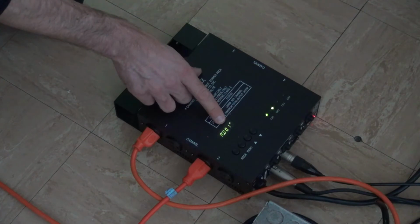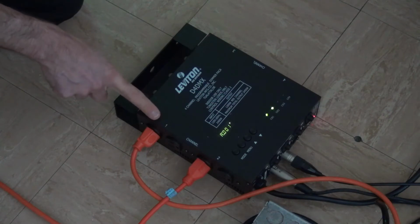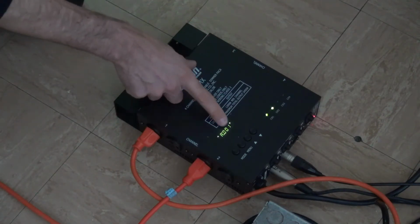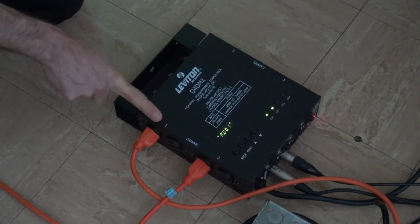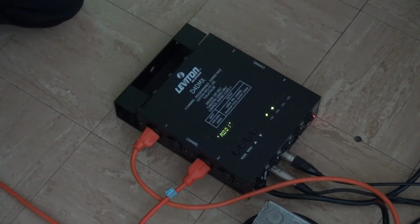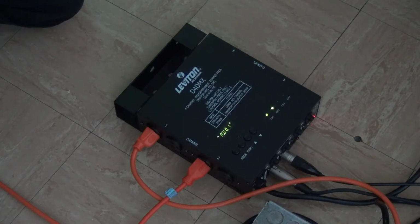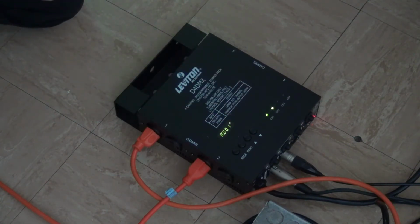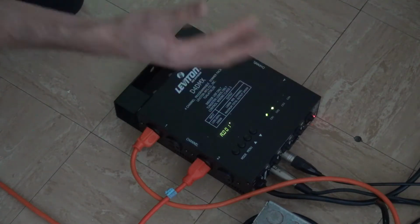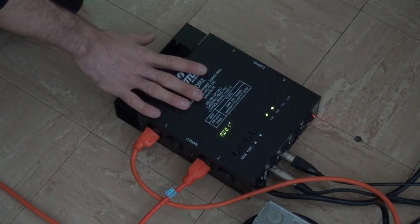You also see on this display that it says 001. This means that our channel 1 here is truly also number 1 on our lighting console in the back. So the internal numbering of these channels starts with channel 1, corresponding to number 1, 2 is 2, 3, 4, and so forth. That also means that channel 1 on our other device, that we'll take a look at in just a second, will actually be internally renumbered as channel number 5. So we can continue our numbering, and we can continue to control individual channels with a secondary or even a third or fourth dimmer pack that we can add to our system.